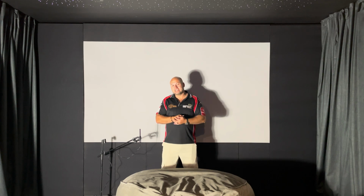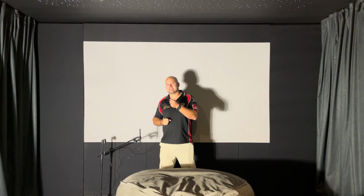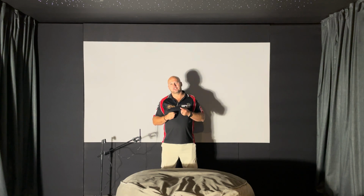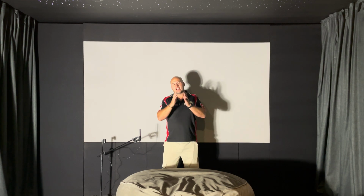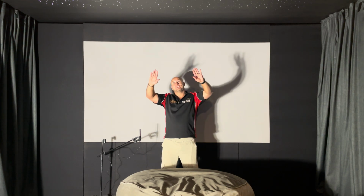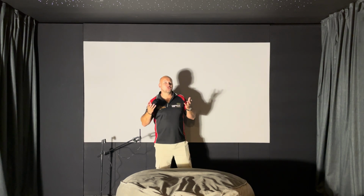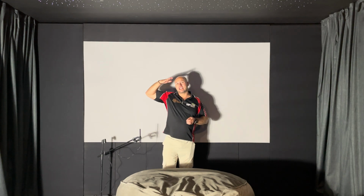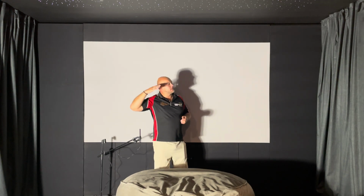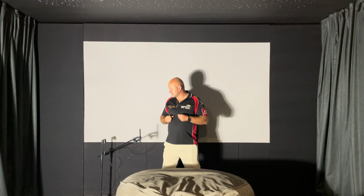So I did a 10 dB Harman curve and I just raised the crossover, even though the system said 70 is good. I wanted to play it a bit safe and let all the subs that I have do the lifting. So I moved them to 80, and then the ones in the ceiling, even though they could do 70, I moved them to 120. Not because they can't do it, but because they start rattling my ceiling board, and I don't want any rattles in the cinema. I just want the tactile bass.